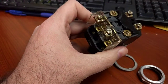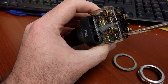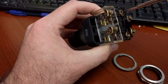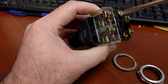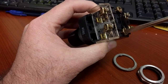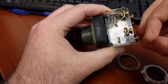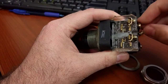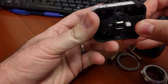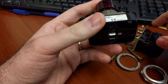The nice thing about most switches is — I'm going to take this apart — it's a matter of just unscrewing these two little mounting screws. This is made in a way so it's kind of idiot-proof; they'll only go on one way. But if I'm out in industry and one of these contact blocks goes bad, I only have to replace a contact block — I don't have to replace the whole switching mechanism. You can see both of these slide out, and on the back side you can see my push button — that little white portion — that's what's going to actuate the contact blocks.